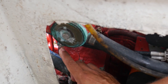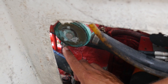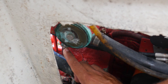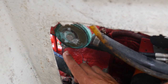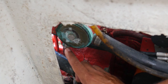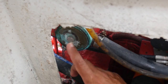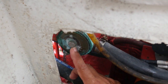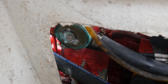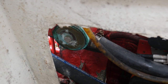And so you make sure that you have your seacock closed so that water's not coming in, and don't forget when you're done to reopen it or you'll burn up your engine. Or just live with water pouring in. And so now I'm going to go find my wrench and pull this thing off. But I just wanted to show you how to find it and make a quick mention. Do not pull the end cap unless you need to. And today is not the day that we need to. So that's it for this chapter. See you in another fraction of your seconds.